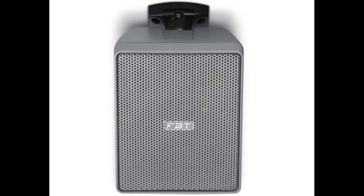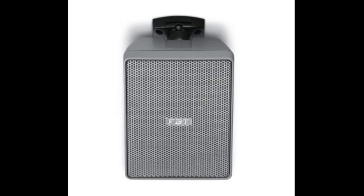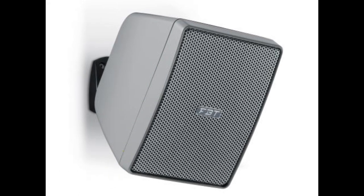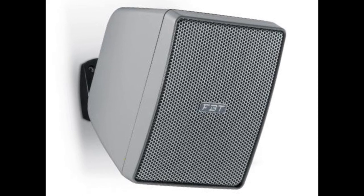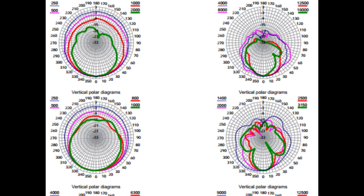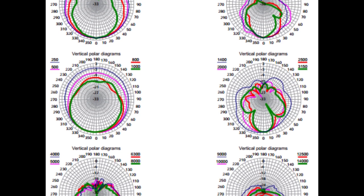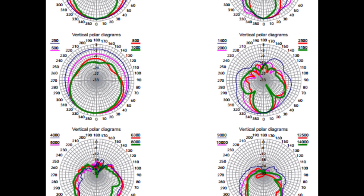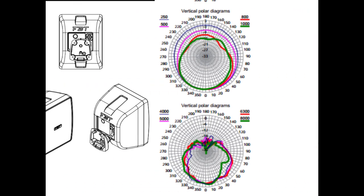Starting with the Shadow 105T — it is the only member of the Shadow series to not have a rotational molded polypropylene enclosure. Instead, it's a smaller enclosure housing a 5-inch woofer and a 1-inch dome tweeter. It has very wide coverage for such a small speaker: 100 degrees horizontal and 70 degrees vertical. Maximum SPL is 110 dB. It was designed for cruise ships, luxury yachts, restaurants, and outdoor sporting events requiring a near-field application.